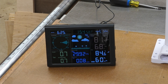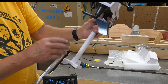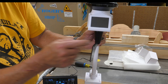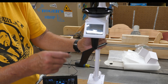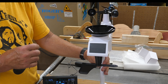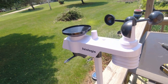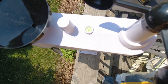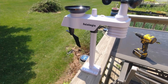I need to take this outside and get it mounted. For the mounting, there's an 'S' right here — it says south. So I'll be mounting this so that that faces south. I know exactly what due south is here because I have two other weather stations around here. That way my wind direction will be correct and you'll also get the best exposure to the solar cell. It's also important to have it level — there's a little level bubble right on top. This is where I've got it mounted for now and I'll leave it here for about a week, then take it up to camp.